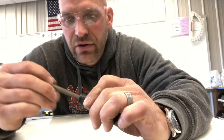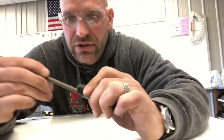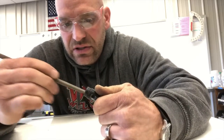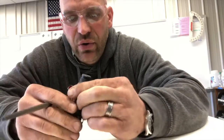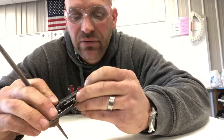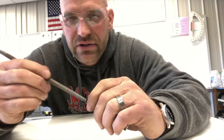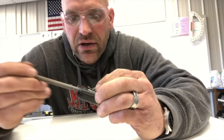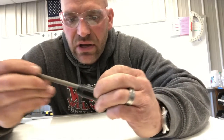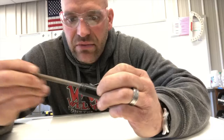There's just a little bit of junk on here, so I'm going to take a file around the inside and just file it a little bit. I'm not looking to take off any metal — what I'm looking to take off is any of the junk still inside there. I once had a battery corrode in here and it was really tough to get out. It left some residue in there, so I'm going to file this just a little bit inside — not going all the way down; I don't want to hit the bottom. I just want to get off anything that could stop a battery from sliding in really easily. Then I'm going to check it and make sure the thing works.